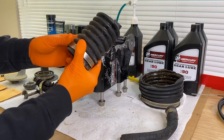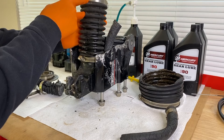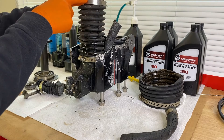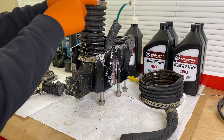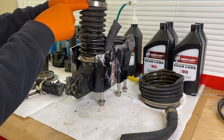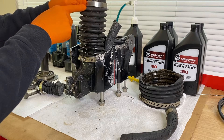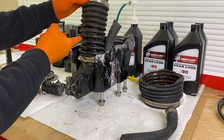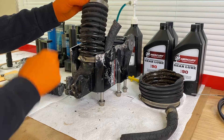Now to the exhaust bellows. Here's where we made our cut, and this portion feeds through the exhaust pipe on the transom plate. This is a little grounding clip — it works in conjunction with your grounded wires and your anode kit to alleviate corrosion to this clamp, which would cause premature failure. In other words, to prevent the clamp from corroding and falling off while you're out riding around in the boat, they designed these grounding clips to go on your bellows. We made our cut as we were removing this from the boat. Right here you can see a little bit of leaking — that is oil.